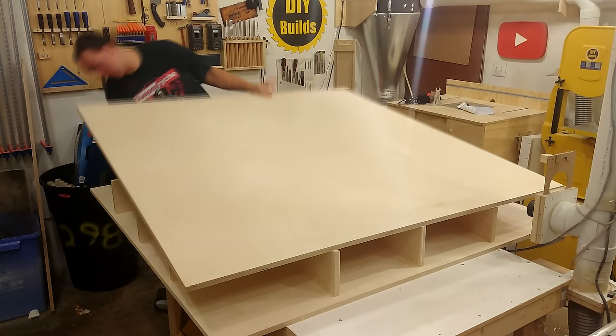After pulling all the cables one at a time through the top, I start pulling them one at a time through the lower drag chain, which will eventually make their way into the control cabinet. I made up a few notched out pieces for spacing away and holding the cables in place.